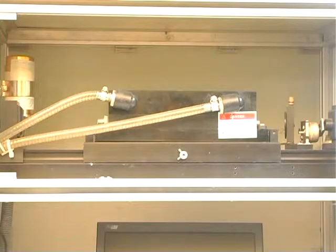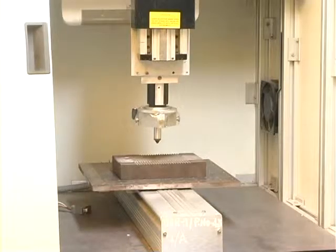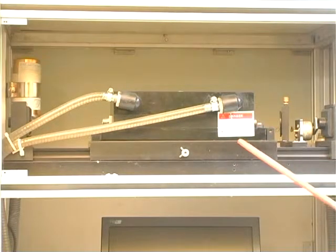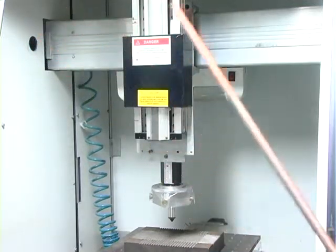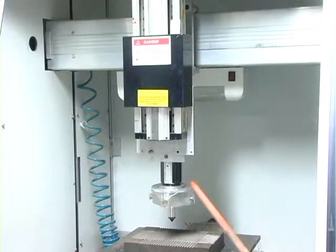This is the laser head. It is capable of delivering an average power of 200 watt and a peak power of 15 kilowatt. The generated laser beam is passed to the workpiece through a laser manipulation system. The laser beam is generated inside the laser head through a flash chamber, hence lasing action is achieved. The laser beam, which comes out of an aperture, strikes the mirror, which is inclined at an angle of 45 degrees, and is passed towards the table through a lens and a nozzle of 1 mm diameter.